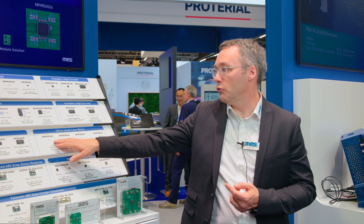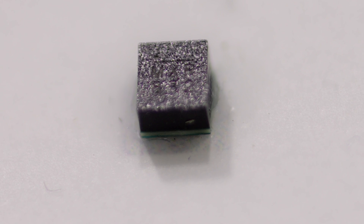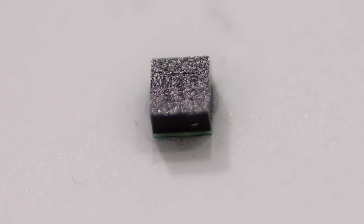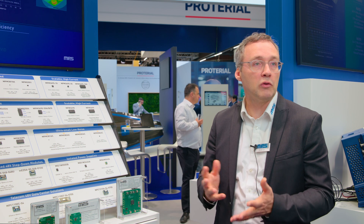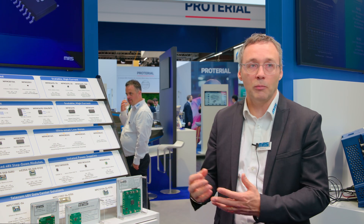We recently introduced a newer family of very tiny low-voltage, low-current modules. They're now fitting in a two by two millimeter package with an inductor. We might use coreless inductors or special magnetic material and special epoxy for the packaging. In packaging, we're also embedding the die inside the frame so it doesn't participate in the height of the component — so we can make very low profile components using tricks like this. The packaging is actually a big part of the module. You would think it's mainly electronics or mainly magnetics, but it's combined. You have to combine all this expertise.